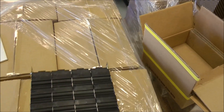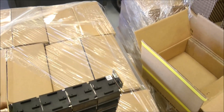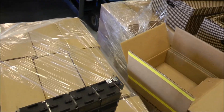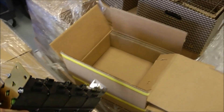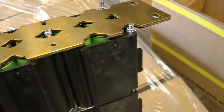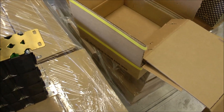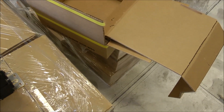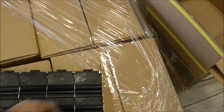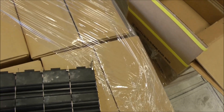This is a battery module from Voltabox. They don't sell the individual cells; they fabricate these module blocks that you then interconnect. Inside these module blocks are A123-26650 high-powered lithium ion cells. If you look down in here, you can see the green — those are the A123-26650 cells. They're placed in a configuration where the cells are already in series, four of them, so there's your 4S stepping up the voltage, and then the rest of the cells in the pack are in parallel.